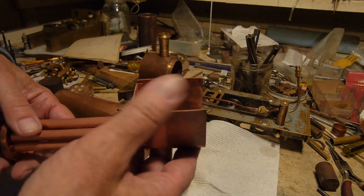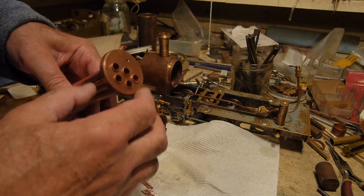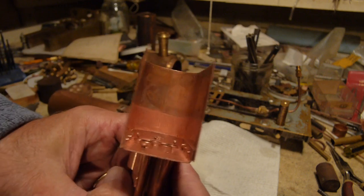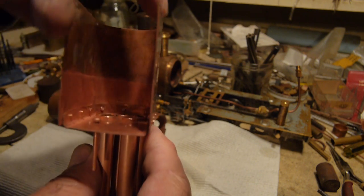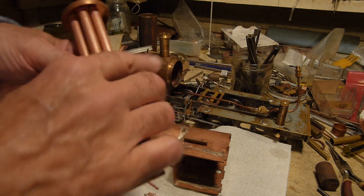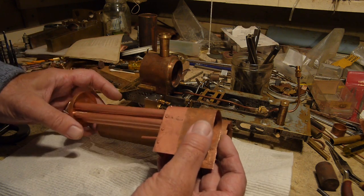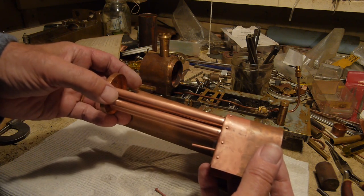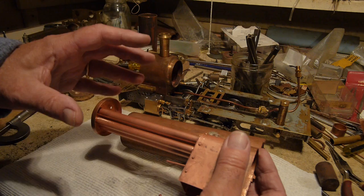I've pushed the tubes into the firebox tube plate and the front tube plate. The front tube plate I've only just recently acid-dipped. I'm going to be brazing here around all these tubes and around this joint. You don't want too much of the tube sticking out — just enough to make it reasonable, all the same distance through the tube plate. I also need to think about the way it fits into the boiler — you always want the tubes running upwards slightly towards the front, as apparently it gives better flow for the hot gases coming up out of the firebox. I'm going to measure that up against the boiler to get the right tilt.